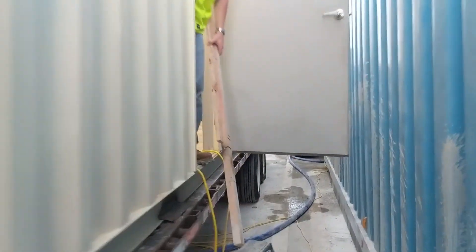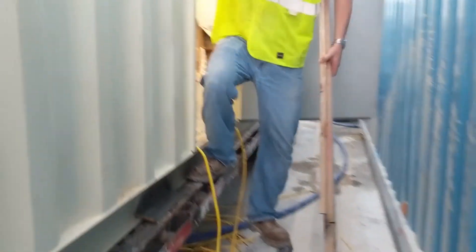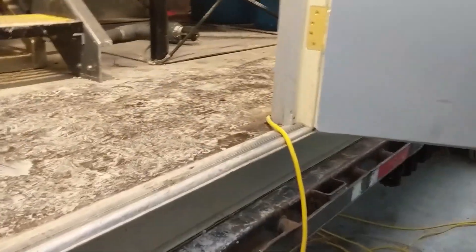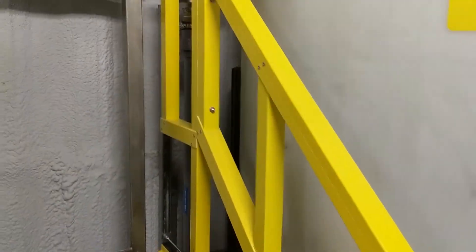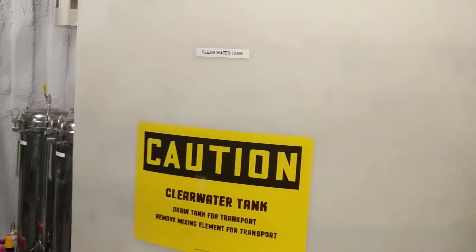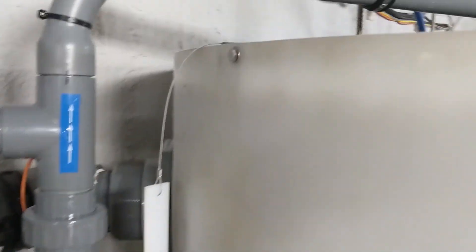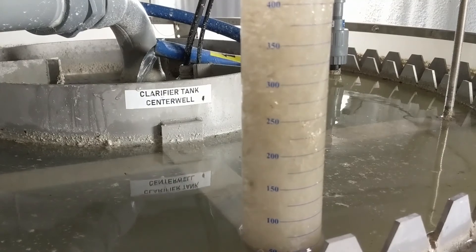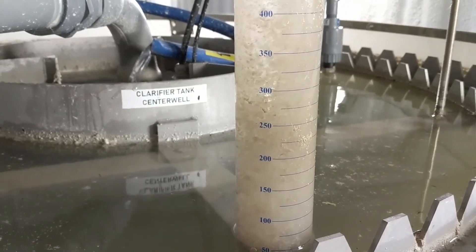This is the service door here. Just doing a little clean up, wrapping up this project. This is our container here. We've got two tanks and a filtering system. Flow comes in the first tank and we're dropping all the solids with a flocculant in this process. The solids will separate and get pulled out with this mud pump here.